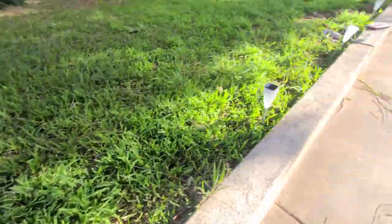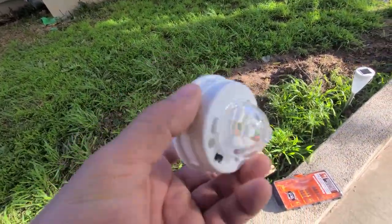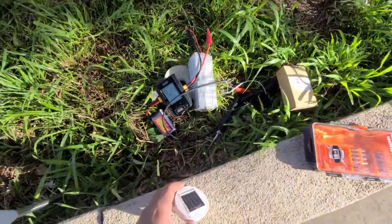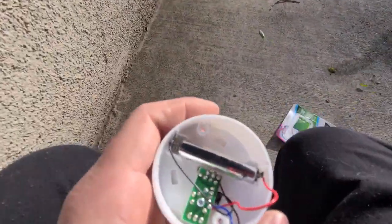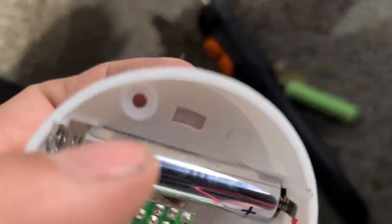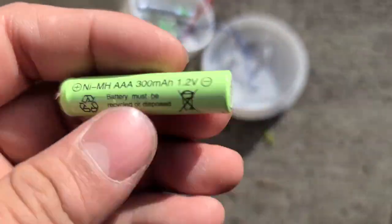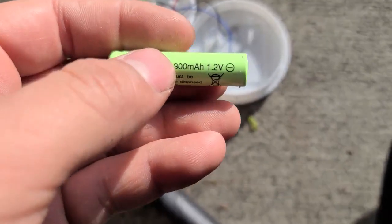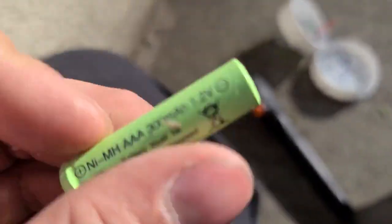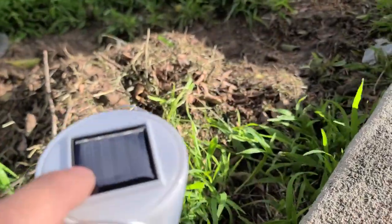What we're going to try now is switching out the battery on this one and seeing if just the battery helps. We're going with an 800 milliamp battery from Energizer — rechargeable, obviously. It's going to replace the no-name brand, which is very lightweight and supposedly 300 milliamps, but I only get like 30 or 40 milliamps out of them actually. So we're going to swap that out — just the battery, no solar cell change on this one. And over here, we're going to swap out both the battery and the solar cell.